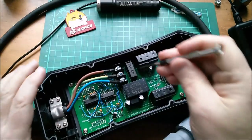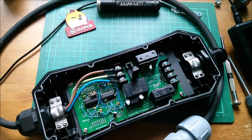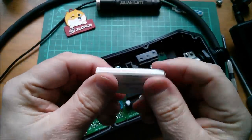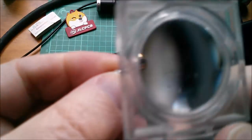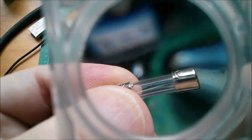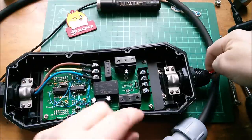Something I've forgotten is the fuse. I think you can use that slot to lift the lid — yes you can. I'll use something like 250mA quick-acting, which should be fine since this thing takes precious little current from the mains to power its own circuit. The wire in here is extraordinarily thin, but that gives me the best safety margin, so I'll use that one. I'll make sure my fingers are nowhere near the mains when testing.